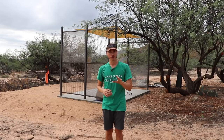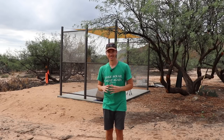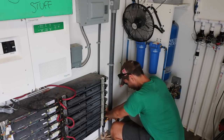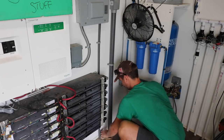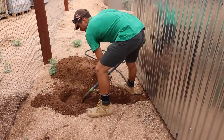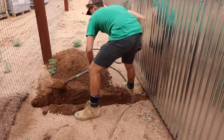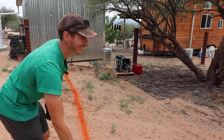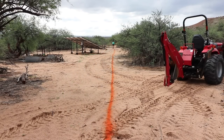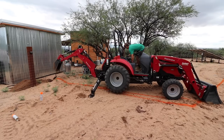Stay with me on this video because I'm going to be dropping some nuggets of gold, especially if you're curious about running wires across a very long distance. Right here I'm using an inch-and-a-quarter auger bit to drill through the floor in the shed. I only have to dig a little bit — about four or five feet — by hand. I'm just using some marking paint to know exactly where I want to be digging the trench with the backhoe; having that visually there makes it a lot easier.